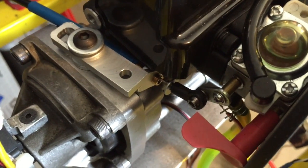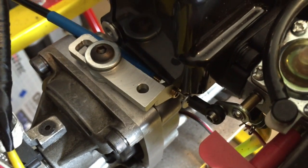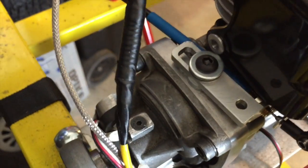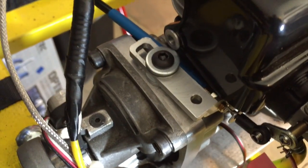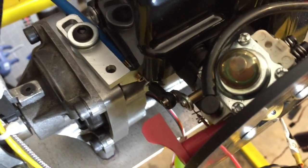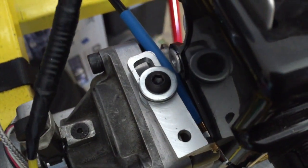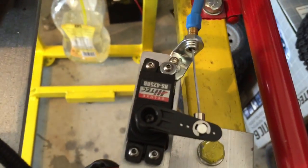I just finished hooking up all this throttle because I was having a problem with the vibration killing the throttle servos. So I've hooked it up over here — I use a couple of different carbs, so I've had to make it compatible with a WYK carb as well, because it's a bit short on the arm. I've got plenty of adjustment here on the fixed point.